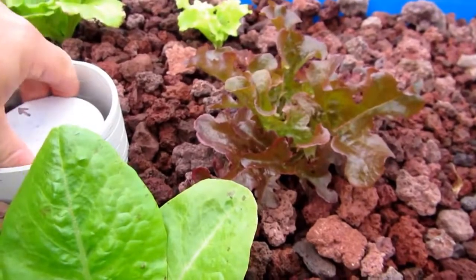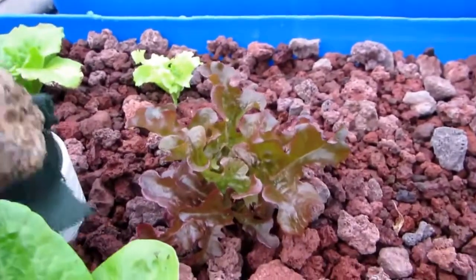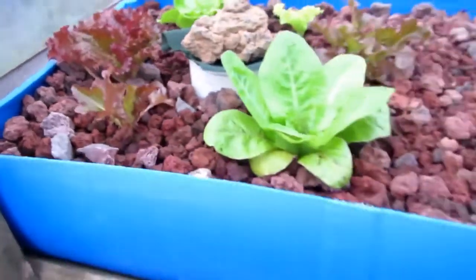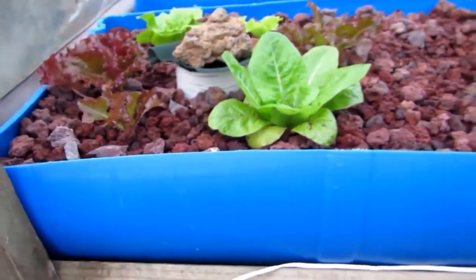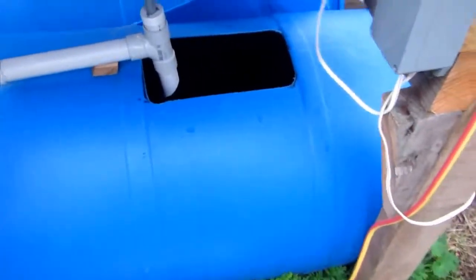The way this works is very simple: as the water rises, it expels the air from inside the siphon, and when there's no air there the water will rush down the pipe, through the venturi, into the tank.